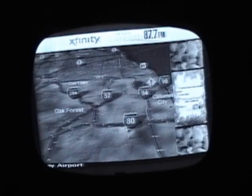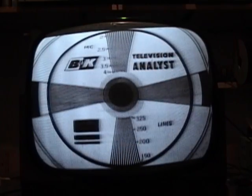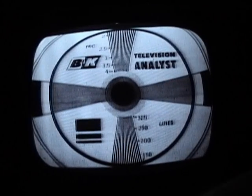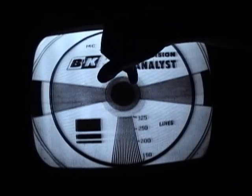Also hooked up my B&K 1077B television analyst. So what channel do I have it on? Channel 2. Oh yeah. In general, not bad, especially the horizontal. Looks like the linearity is pretty good. We've also got pretty good bandwidth. See these numbers here. Does indicate the bandwidth. The idea is if you can still distinguish the stripes, you've got good bandwidth. And I can still see stripes at 3.5, even kind of at 4, which is just fine.